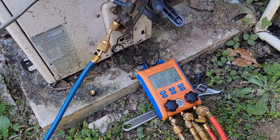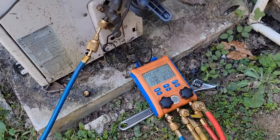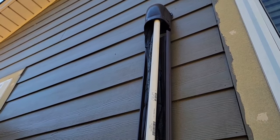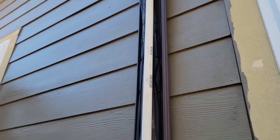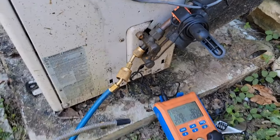No visible oil. We definitely need to get some nitrogen and do a nitrogen leak test. These connections have been welded, so there's no longer a flare connection up there. These are the only flare connections, and I'm not getting any beeps.